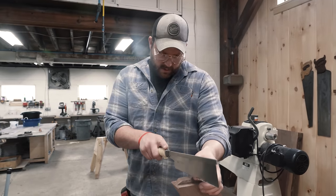The shaping of the bottom went pretty smooth, I gotta say. Very surprised by that. So the system we've come up with is this. We're going to have our string come through a hole, and then I cut this little groove. We're gonna poke another hole for it to come down, and then we've got a bolt into a countersunk threaded insert, and the bolt's got a hole in it, so we can turn this and create tension on those sides. The center point's going to be fixed, so I gotta put one more insert in and then we'll go over to the drill press and drill these holes.